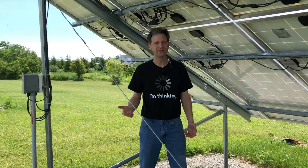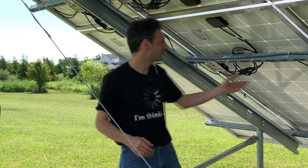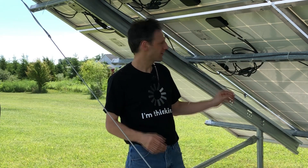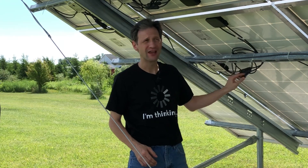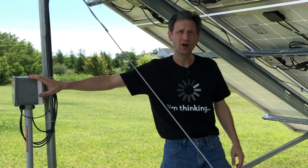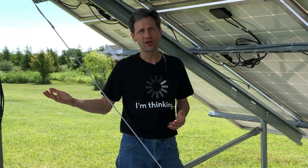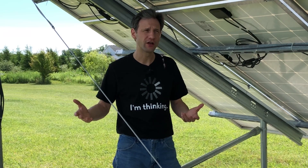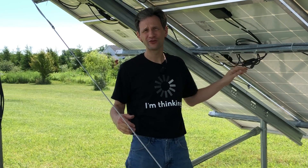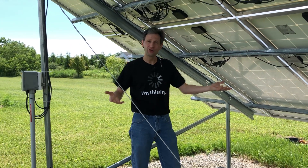Hi, welcome back to Projects with Everyday Dave. If you're building a home solar panel system, at some point you're going to have to deal with these MC4 connections. Solar panels generally come with them — there's a male and a female version — and if you want to connect those panels to your home or some other combiner box, you'll need a cable that has an MC4 connector on one end and bare wire on the other, to go into a lug or a wire nut. So today I'm just going to do a quick tutorial on assembling these MC4 connectors, I'll tell you where I got my materials, and what you need to know to put them together. So let's put one together.